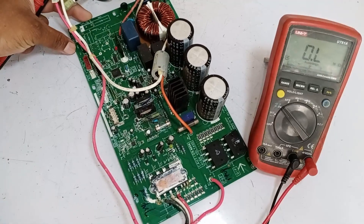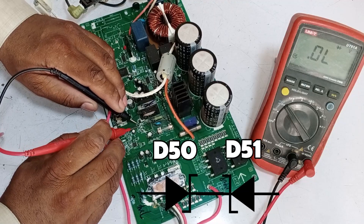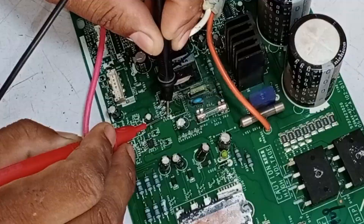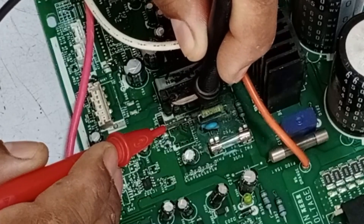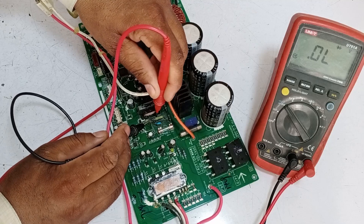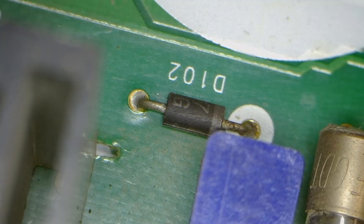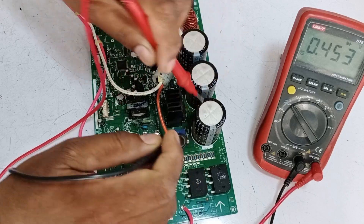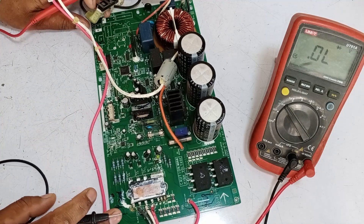We will first test the SMPS system to make sure there's no issue with it. We'll check all the diodes here — first diode 51 and then diode 50. These two diodes are opposite to each other in terms of polarity. Placing the probes on the diode, it is fine. Diode 52 is also perfectly fine, diode 55 was fine as well, and diode 53 is also in good condition. We should also check each diode with reverse polarity to ensure there's no leakage — everything looks perfectly fine. It's also essential to check the recovery diode, diode 102, as these can often fail. After testing it, it shows correct voltage drop values, confirming the recovery diode is working correctly, meaning many of the components are in good condition.